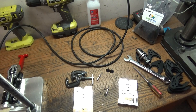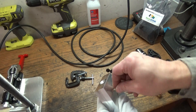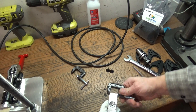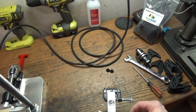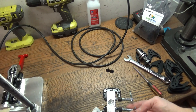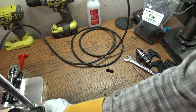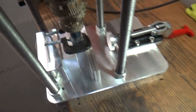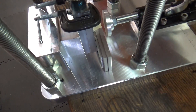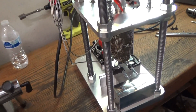I'm just going to continue making more of these. The mold's not real hot. I filled it back up before I took the mold out so it should have enough heated material in there and we should be ready for another shot. Getting the timing down is a little tricky but it's going to take some time. I get it clamped in there and centered — I don't have my stop hooked up yet.